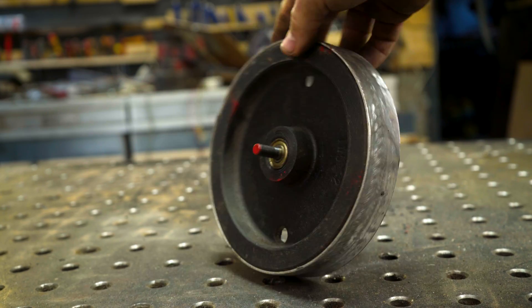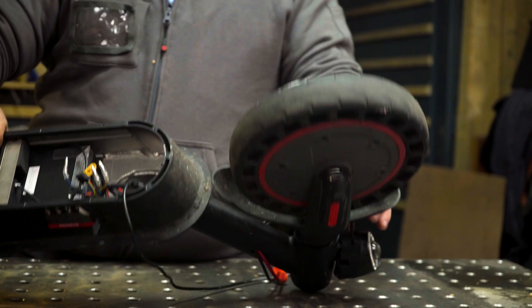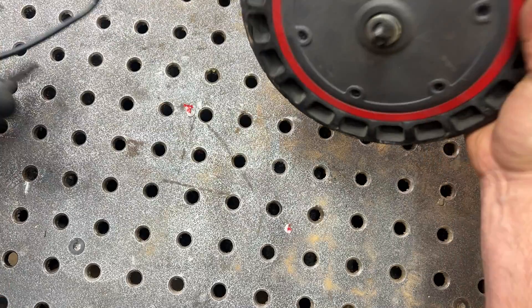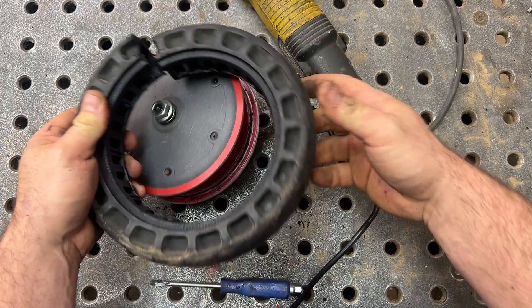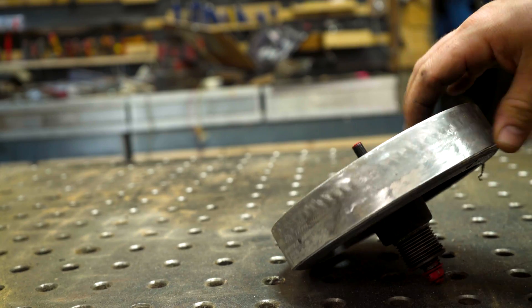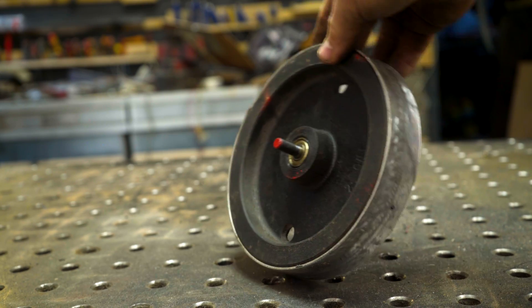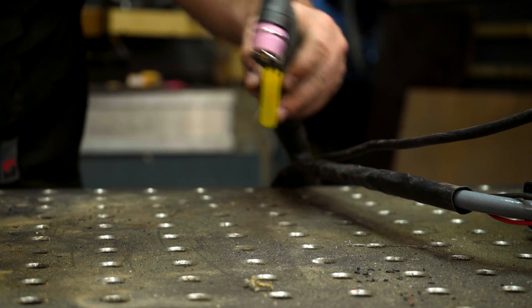Today we are going to modify and make everything as light as possible. The plan is to take a motor from an electric scooter and remove the weight — in this case the rubber wheel isn't necessary — and cut away the very heavy cast iron wheel. The goal is to have everything as light as possible so the kayak stays light and I can transport everything easily from my house to the lake or sea.